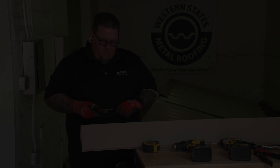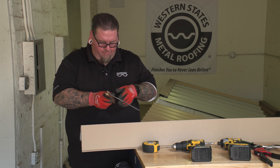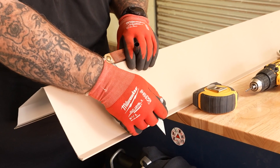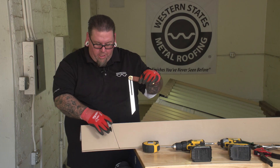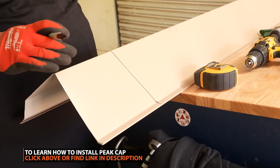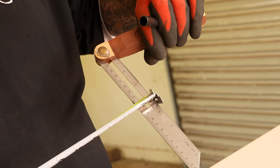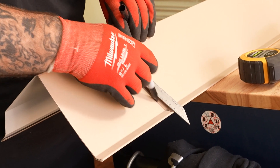What we're going to do is add this T-bevel to recreate the same angle. Set it on top. This angle right here will come out perpendicular after you make this cut. We're going to add a one-inch tab and do our mitered 45 degrees here so the peak cap will line up with this mitered 45 on the back end, and this will make a nice clean tab. This ruler happens to be one inch thick — for a quick tab, if you know your tools, this tool right here is one inch thick. I need to put a one-inch tab on the back, so I'll put it back on its mark and there's my tab right there.